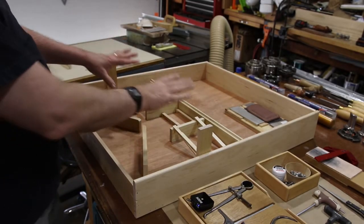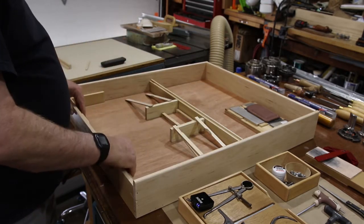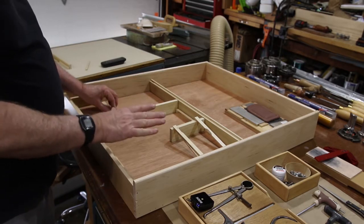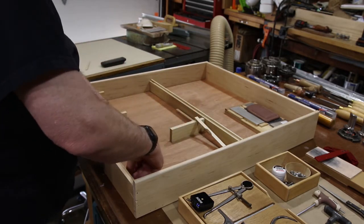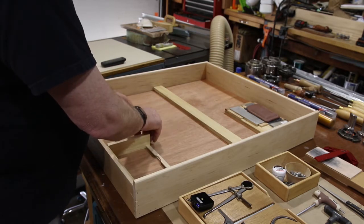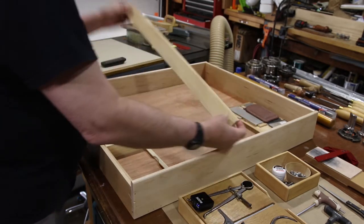Well, here we go. So by interlocking all of these pieces, we're going to create the first front part of the box to drop tools into. So we start with the two side pieces, slide in the centers, a locking piece to hold those together, and then these small pieces here will be the spacer for lifting the pocket off the floor. Everything just goes right into its place. Again, spacers. This way it all stays square. Stuff does move around on you a little bit. Alright, come on, you little devil. This is the rail for the till.